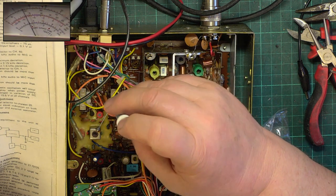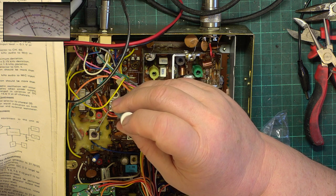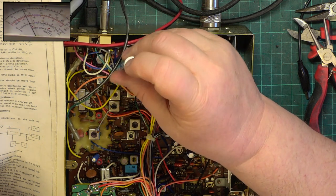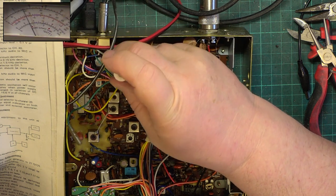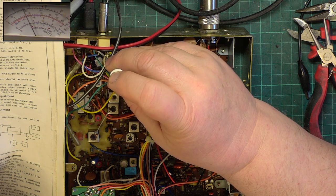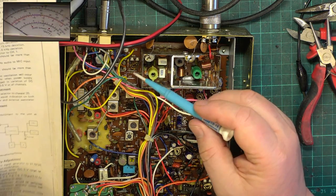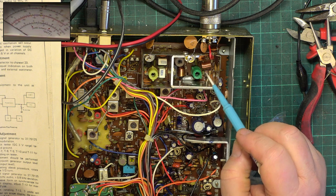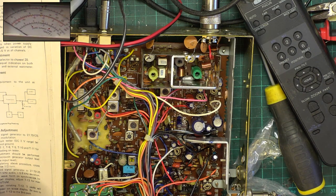So we're doing 3.6 watts. Yeah, picture in picture's on. Not easy to get into that. Nevertheless, we're there. So next we're going to go across to these three, and I have to look at the instructions every single time with this. So it's L4, L8, L9. First of all, we adjust them for maximum. To do that, we need the green plastic trimming tool.